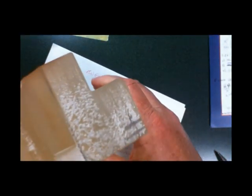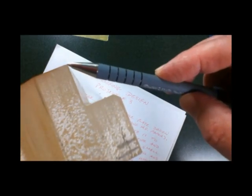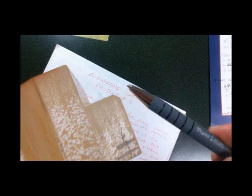If we slide this down a little bit, this is actually a filleted edge right here. So this edge is a one-sixteenth fillet and this edge right here is a 45-degree chamfer. If we look from the side, there's a little bit of a quarter circle here — that's the sixteenth-of-an-inch fillet. And then you can see there's a 45-degree slash running along the side here — that's a 45-degree chamfer, and it's an eighth of an inch in its length.